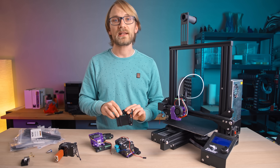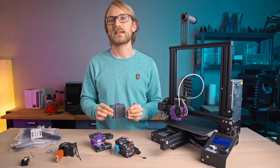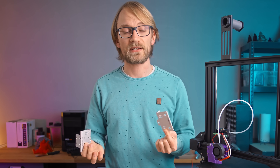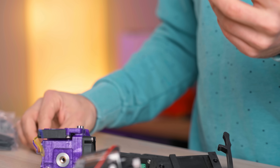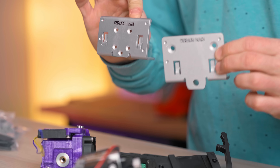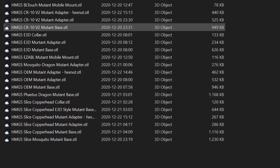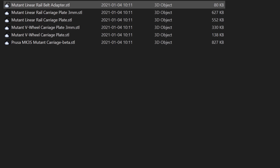It's similar on the fixed plate, but you only get four holes to mount it. You can drill your own, but by default this didn't directly fit any printers I have. WhamBam do offer custom carriages that directly fit the Mutant for both linear rail setups as well as V-wheel setups like on the Ender 3 or all the Ender 3 lookalikes, which simply replaces your entire carriage and provides belt clamping and the mounting points for the Mutant's fixed plate — very chunky and solid. The general idea though is to use adapters for the fixed and mobile plates. You can grab those from Thingiverse, and Media Man, who has designed the Hero Me system for Creality machines, has already adapted his mount to the Mutant and you can use those for a pretty big range of hotends already.